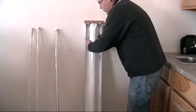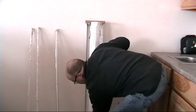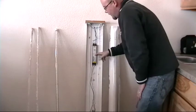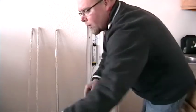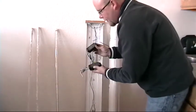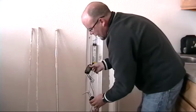So you remove your bulbs and simply pull this cover off of the light fixture, and here you have your ballast. What we're going to be doing is cutting these wires and bypassing this ballast, and putting in the drivers — the AC to DC drivers — which will bolt in here, with one going to each bulb.